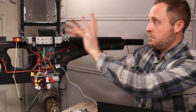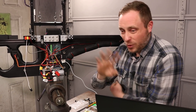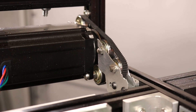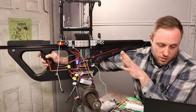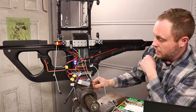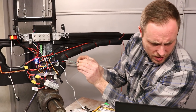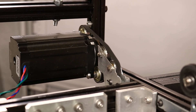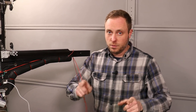I have three tests to run to get everything set up for how fast the stepper is supposed to move the cylinder, but first I want to test it and just make sure it turns the stepper motor and everything's going to be okay. When I press this it should move very slowly. Well, this is hysterically slow — I'm going to need to ramp it up. The trigger is set up to increase the maximum RPM limit by 10 each click. The self-test button boosts acceleration by 100 every press. We went up to 60 RPM and 400 acceleration, then reset it to slow, put the cylinder in, and started bumping it up little by little.